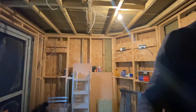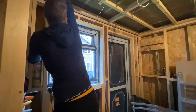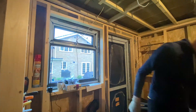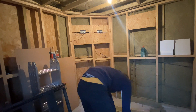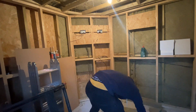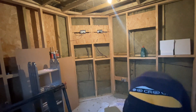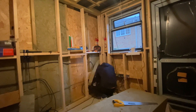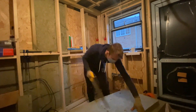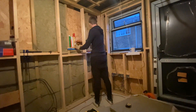The ceiling joists are 400 millimetre centres so you do have to do a bit more cutting there, but it's nice to not have to cut every single slab if you stick with industry standard sizing, which will also come in handy later when we come to do the plasterboarding. I found the best way to cut it was using a fine wood saw. Make sure you wear gloves and a face mask as it's irritating stuff to touch and not something you want to be breathing in.